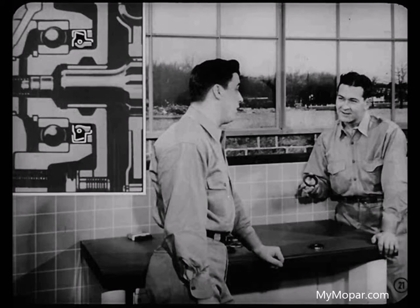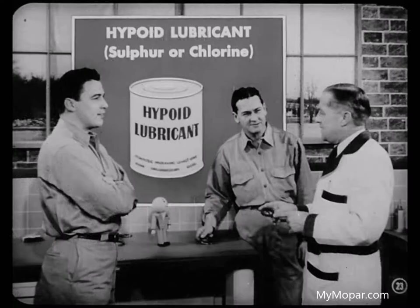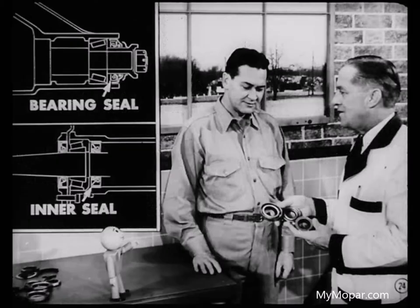The metal container also allows for easy removal and installation of the seal. Encased seals are found at the front wheel inner bearing, as inner and outer seals at the rear axle shaft bearings, at the rear axle pinion shaft front bearing, on both the standard and hydraulically operated transmissions, on the overdrive unit, and on the torque converter.